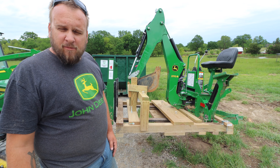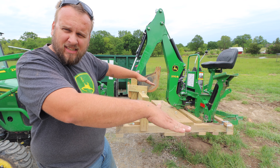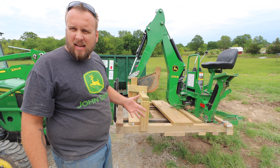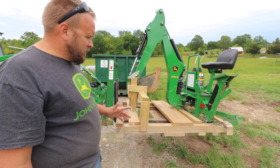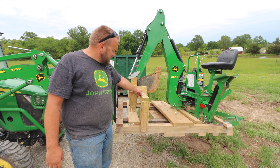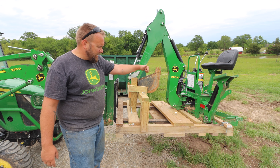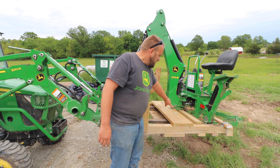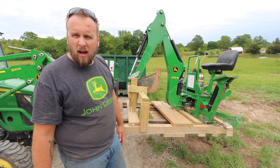So this is the way I've been hauling it. I now have a slightly better angle and I've got the tractor sitting downhill, which makes it worse — so it's a good way to test in a worse scenario. I think it is sitting a little bit better, but I also think putting these eye rings on here is a good idea. I'm going to run one around the frame to hold this from sliding forward, then put another one over the backhoe and fasten it down, and we'll take it for a ride.